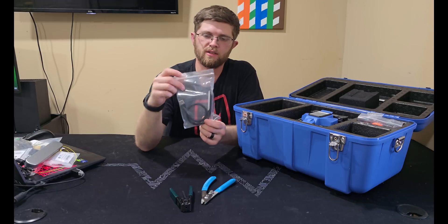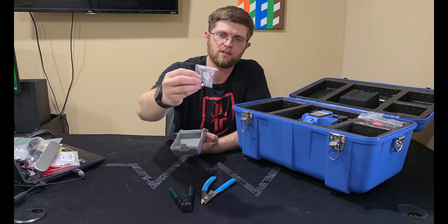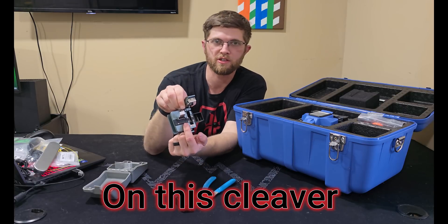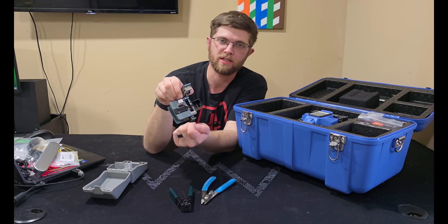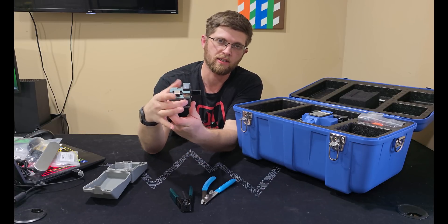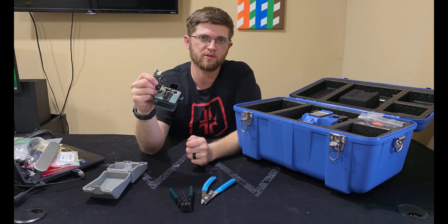You get a little USB light that plugs in and lights up while you're splicing. You get the cleaver they include, and allen keys to undo the set screws so you can rotate the blade. On the splicer, if you want to use those trays, you undo the set screw, put your fiber in the tray, load it into the cleaver, cleave it, then plop the whole tray into the splicer.